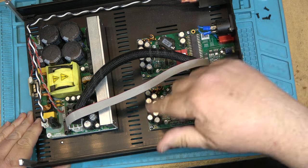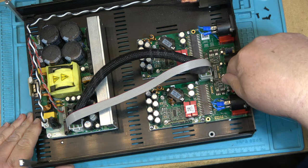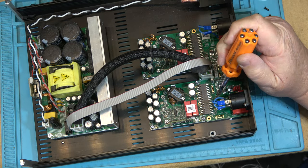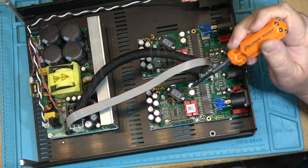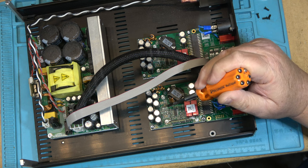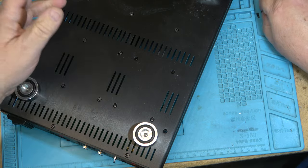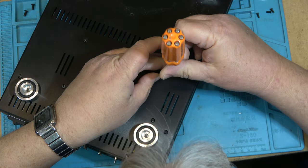This is just the interface, this one, right, for the power supply, to get power from the power supply into the module, get the audio in from the audio input on the back, and then the audio out that goes to the speakers. You can see right here, if we look down here, these two great big copper traces, these are the audio out. So after it's filtered, and the filtering is done in here in these stages. I would imagine if I put my scope in here, we could probe some of these caps and we'd see the class D square waveform, which I've done before. I've shown you guys how Class D operates. It's not rocket science. It's how these things work.